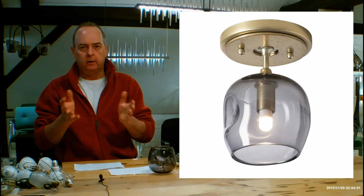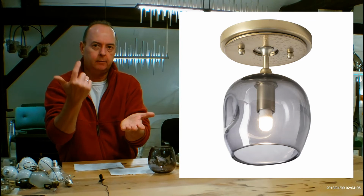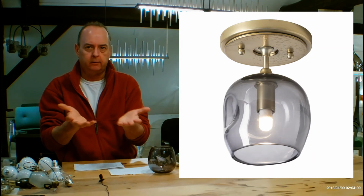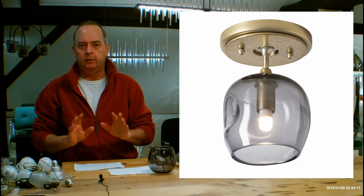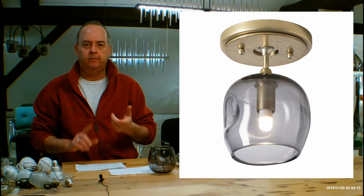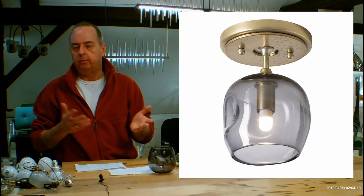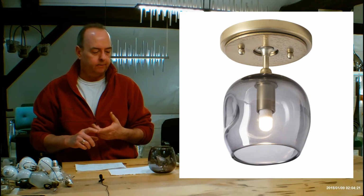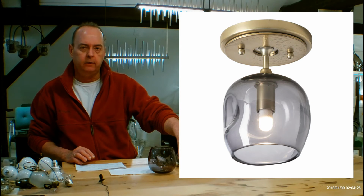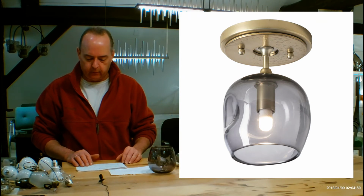If you want to go a little bit more neutral, and this is considered a warm white, on my hands, the light coming from the light above me, this is 3000 Kelvin. That's the one I think you should zero in on. If you like the blue light, which is called daylight, and that's the stuff outside, that's going to be 4000, 5000 Kelvin. The bulbs are so cheap, you might as well play around with them a bit, but I would probably start off on this fixture with, if you're doing LEDs, a 60 watt equivalent, 3000 Kelvin G9. That would be a good starting point for you.